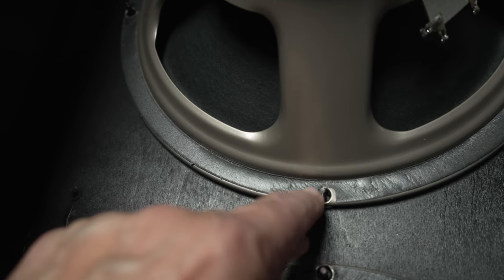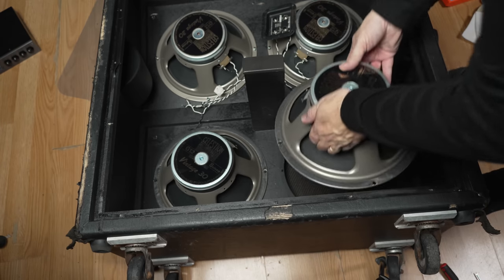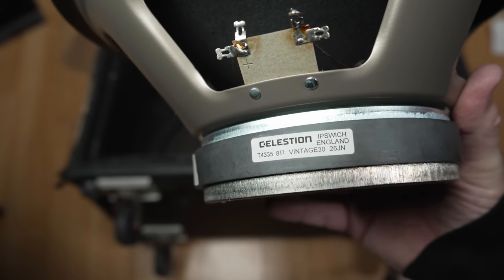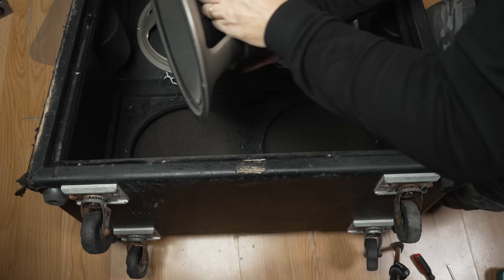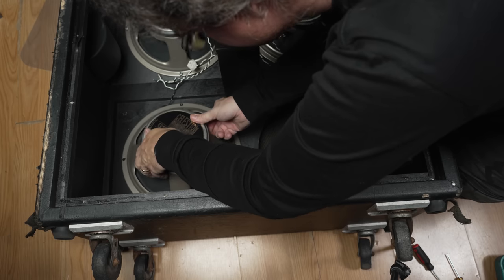Cabling's removed, nuts are removed. We want to be very careful when pulling these up that we don't accidentally drop them back on here the wrong way, because they will go right through the speaker cones. Just grab firmly and they'll come right up — no problem. The little 50 on the cone indicates made in China. I already went ahead and made some recordings with the 2006 Vintage 30s from the angle cab in spaces 3 and 4, and even took some frequency response graphs. We're dropping the originals back in now — the ones that say Ipswich England — and running the same tracks through to see what kind of tonal difference we get.